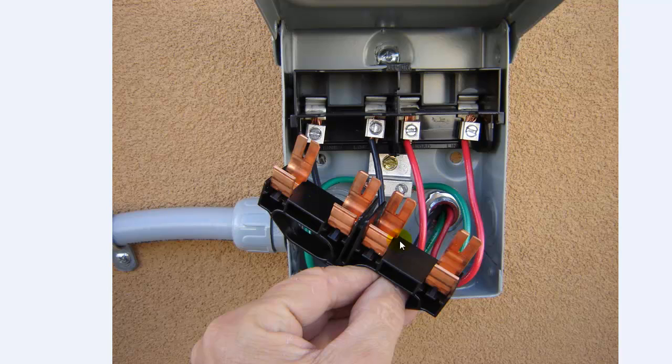This is your fuse holder here. I didn't have any fuses when I snapped this picture, but you just put your fuses in on each side — 25 amp max fuse size is what goes in there. You plug it in one direction and it's in the off position, meaning the line and the load wouldn't make any contact. If you flip it upside down, those forks of the fuse block holder would be up top so you wouldn't be making any connection — that's the off position. When you flip it back around and plug it in, that makes your connection which runs through the two fuses.